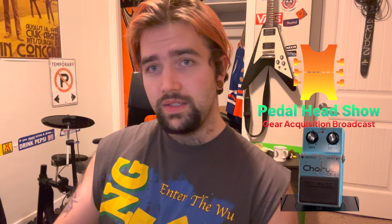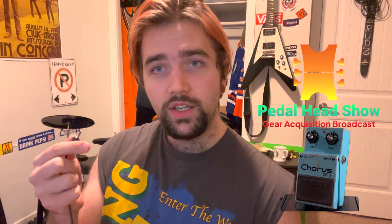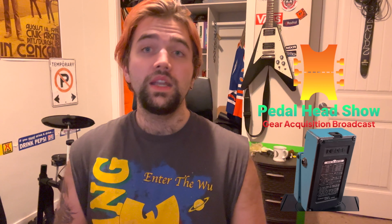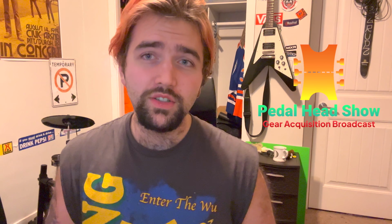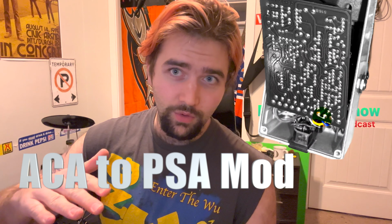So I plugged the DC cable in and out and I saw the LED get darker or dimmer, and when I unplugged it, it went brighter. So I figured it must have something to do with the power. Either the power jack, this guy, or maybe the resistor and diode that breaks down 12 volts down to 9 volts.